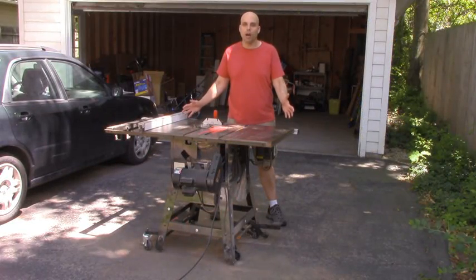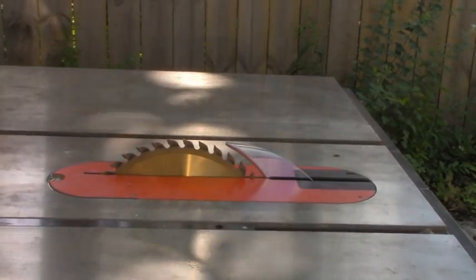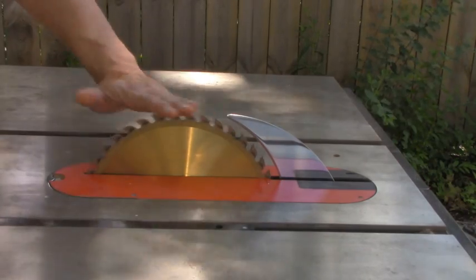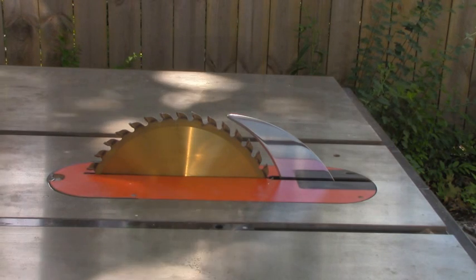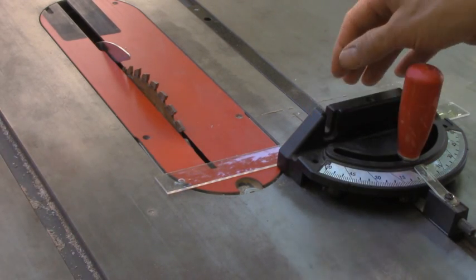So now we're outside, because when it comes to making really clean, straight cuts in acrylic, what I like is the table saw. They make all kinds of fancy table saw blades for cutting plastic and other synthetics, but you really don't need one, especially if you're only doing occasional cuts. This is a regular carbide-tipped combination blade, and I find it works just fine. Most of the woodworking techniques you already use with your table saw are going to work with acrylic, but some things are different.